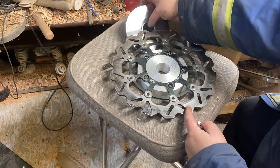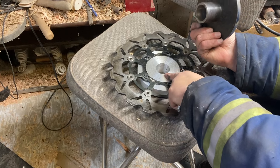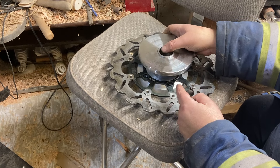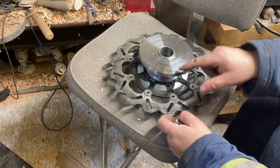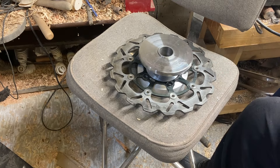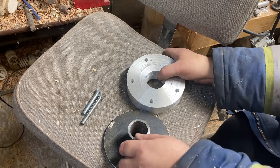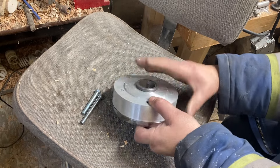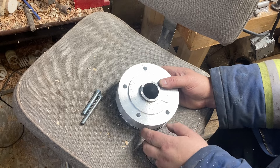So what are we going to do with this flange? If you don't have any holes drilled in here the bolts won't go through. We're going to bore this center hole out to that diameter, drop that through there, then drill the holes through the spacer, through the rotor, and into that — and hopefully everything will all be lined up. Got this thing bored out now to the size we need. We can slide that into there like that — it's nice and tight. Then we can drill our holes through and everything will line up.